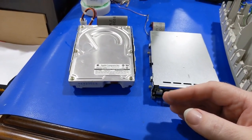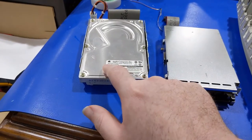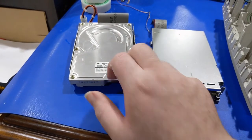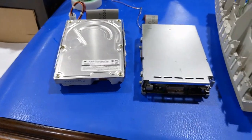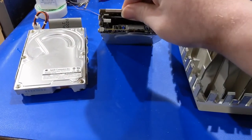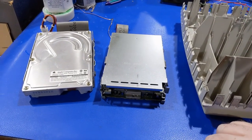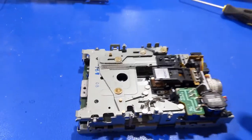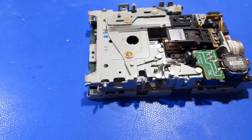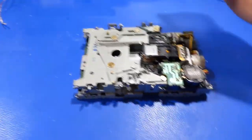I don't know if I'll go into that level of detail with this drive, but I will take it apart and do an inspection on the rubber quality, because I know these all fail depending on how they were stored. Now that we've got the drive apart — just four screws, two here, two here — here's the cover. Key things we need to do: re-lubricate critical points and remove this head support bracket to allow the head to lower carefully.